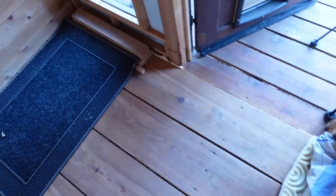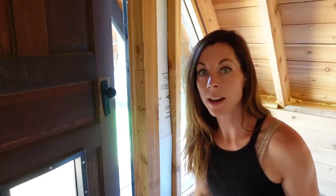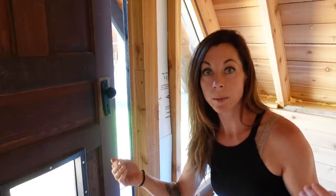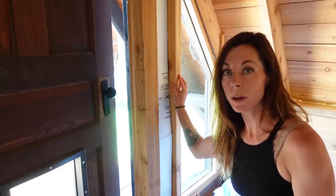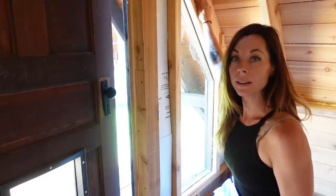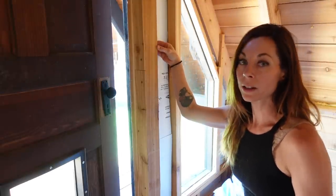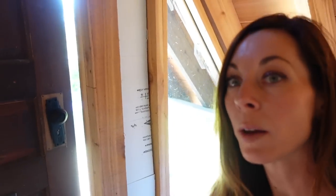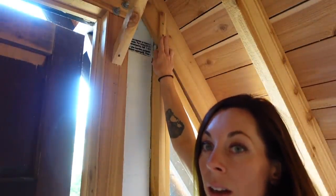But yeah, I mean, it's super cute. This whole thing is made out of cedar. It's for this reason that I've decided to mill up four rafters for each gable end. I remember thinking about when I did this doghouse and I put these windows in the front. See, this is all 3x3 timber frame. And when I went to put this window in and frame it against this rafter, I had a 1.5 inch rafter, but I also had a 3 inch timber. So I had to really scrap together this whole piece to frame it in because it was thicker, right?